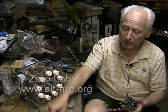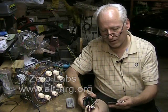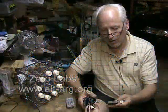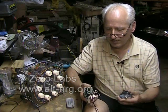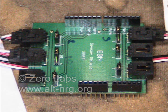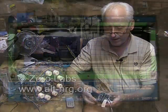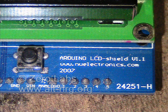This is a leftover from the EBN project some time ago, and the Arduino board that I have is a Duemilanove — D-U-E-M-I-L-A-N-O-V-E, it's Italian. So to all of you Italians, if I've really made a mess of this name, I apologize. I've got the input shield, a high-current output shield with six MOSFETs — they are IRF-Z44N MOSFETs for the output — and I have the Arduino LCD shield version 1.1 that go along with the Arduino processor.